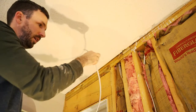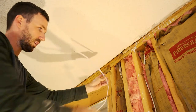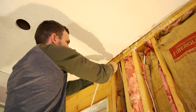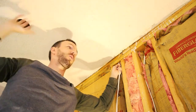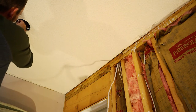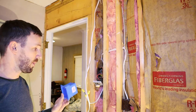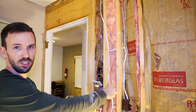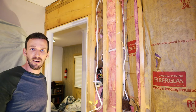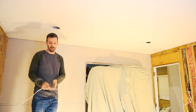I'm using 14-2 Romex here. I'm going to curve it so it curves towards my hole behind me — I need to get as close as I can. If you have drywall up, you'll need to cut out an access hole so you can drill through the sill, or use a hole that's already there like I'm doing. Just keep shoving wire up there and eventually enough of it will start coiling over in the right direction. I'm going to put my light switch box somewhere around here, so I need a ton of extra cable. Now we're going to run wire from light two over to light one — you can do it vice versa.